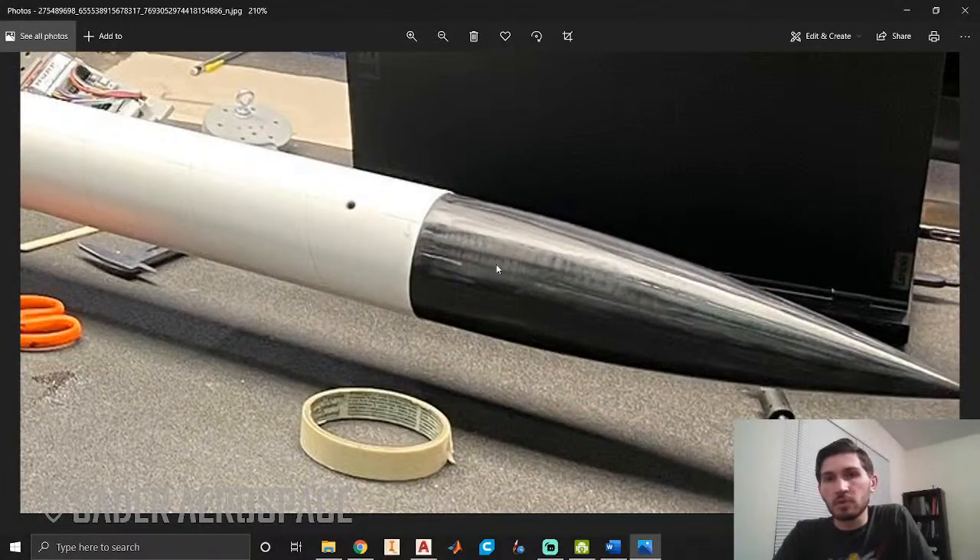If you see how it looks all weird on this surface, the reason why is because originally the whole nose cone, since it's a plastic cast part, the surface is kind of rough — it had little ridges all across the surface, which weren't quite what I wanted for the look of my rocket. Other nose cones are typically a lot smoother, but these ones weren't. So what I did is I went through and sanded this down a ton with a polishing wheel at the UAH machine shop, just kind of buffed it through. So it looks all weird and textured there, but really that surface is super, super smooth. Then I went over it with sandpaper to rough it up enough for the eventual paint and primer to grip to it.